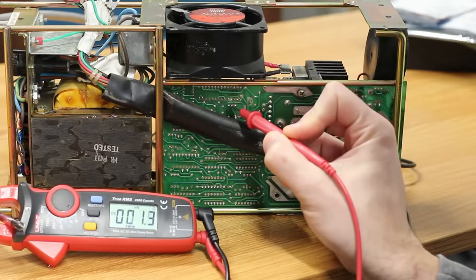To get the diodes out I'll desolder them with my RadioShack desoldering iron, but the proximity to the metal frame makes it a little awkward. I flipped the supply over to try to free them from the top side — and because I'm a barbarian, that didn't go smoothly. I managed to break two diodes completely in half; one was totally unrelated, and only one came out unscathed. These are just 1N4004s and I have three replacements, so we should be fine. I did check the surviving one with the multimeter and it's totally shorted — so this was absolutely a problem.